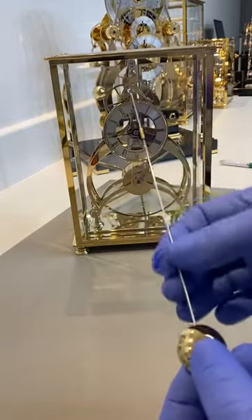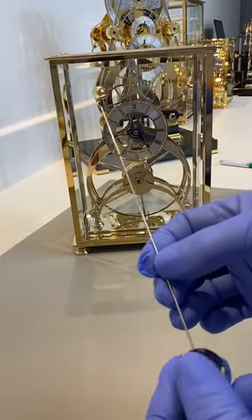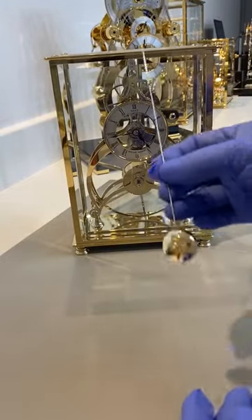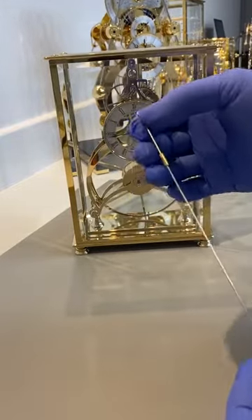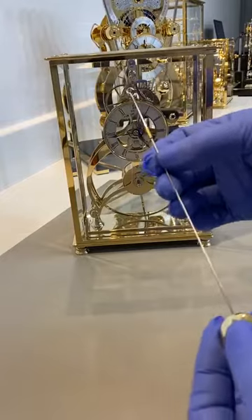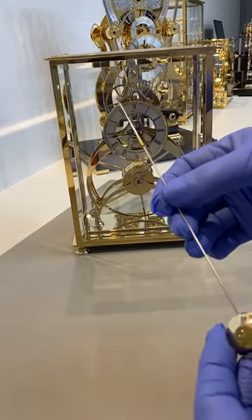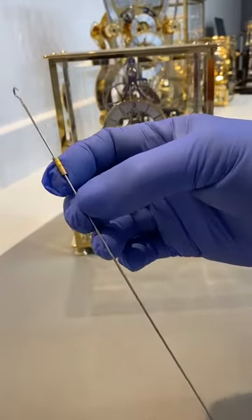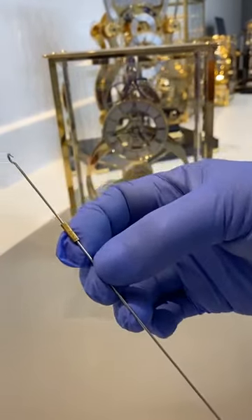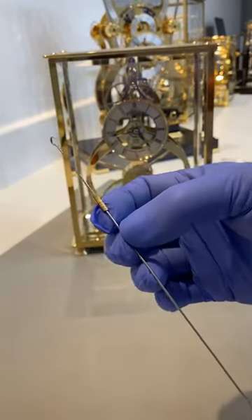This is one millimeter diameter, made of Invar, which is a low coefficient of thermal expansion material. It's hooked onto a silk suspension — well, it's actually fishing line. It's hooked onto a silk suspension and you have this little sleeve here. This is actually two sleeves because this was the very first one, so obviously the first one wasn't long enough.